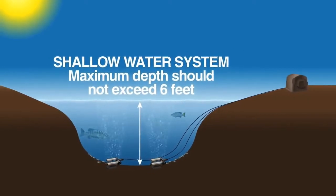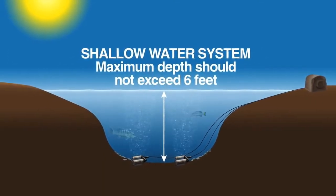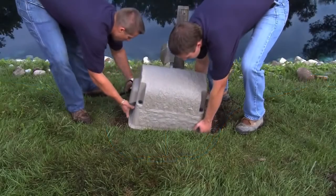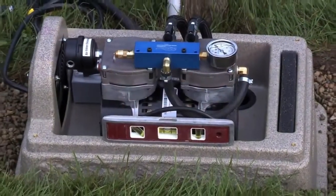Remember to always place your cabinet several feet higher than the highest water line of your pond to avoid flooding in the spring or during heavy rains. This is also important when placing shallow water diffusers — the depth should never exceed what is recommended for the shallow water system. Heavy rains may cause the water to exceed the recommended depth, damaging or causing accelerated wear to the compressor. Once the ground is prepped, place the cabinet and use a small level to ensure it rests securely and is level.